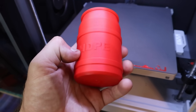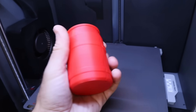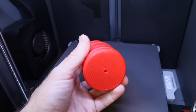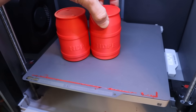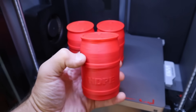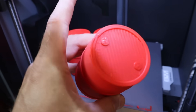I'm going to print two more of these. This one is number three — I had the door completely open on this print, and there's still a little bit of an issue on the overhangs but not too bad. This is printed with a 0.2 millimeter layer height. This one was door open as well but not quite as far. These two look very similar to me. The door all the way open looked the best. This one here has some more irregularities — it was printed with the door completely closed. On all these prints, the top is on as well.